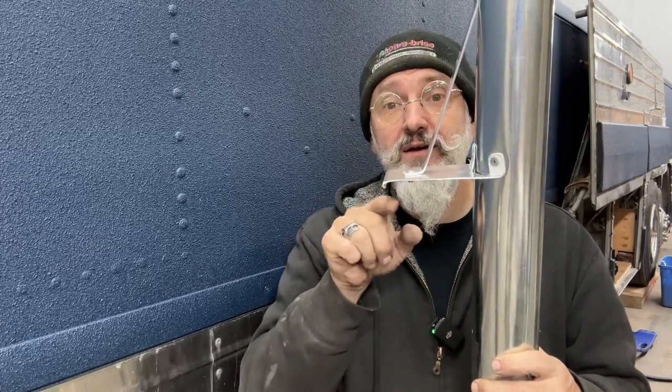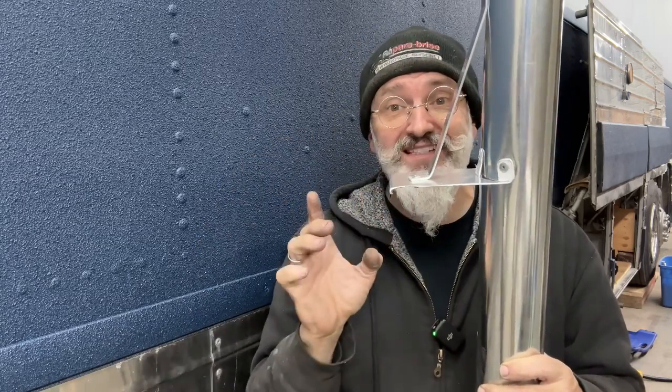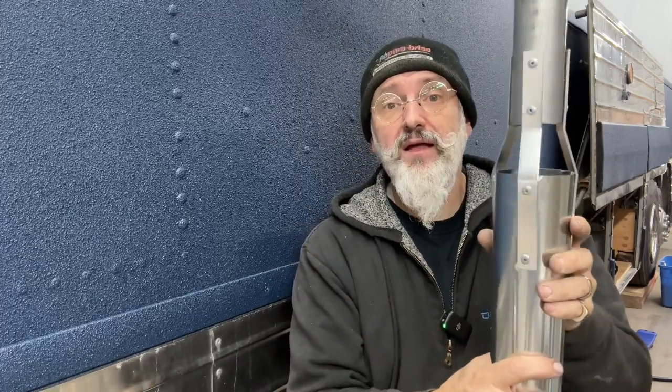We made a bracket here to hold it onto the pipe, and a little hook that holds it on the door. On the bottom end, we have this riveted on with a 2-inch gap. That 2-inch gap is the same diameter as this tube — that's the best ratio for the venturi. If you have an inch and a half tubing, all you need to do is put an inch and a half space. We use the 3-inch tubing on top, riveted together, and now it's good to go.